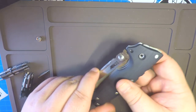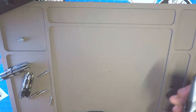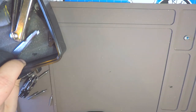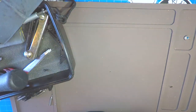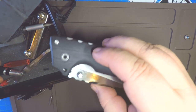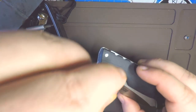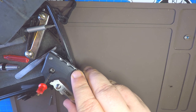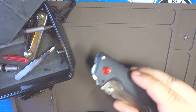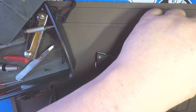Now we can try to knock that pivot out. I haven't got my Demco official hole-in-the-hockey-puck thing - I wouldn't mind getting one of those or just drilling one out, but I haven't done it yet. So let's get a little broken screwdriver, put it in the hole nicely, and then just give a little tap tap tap so it comes out. Comes out pretty easily - you don't have to beat it to death.